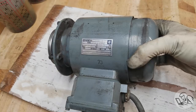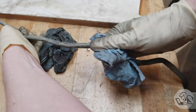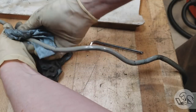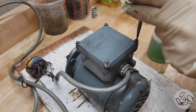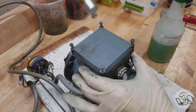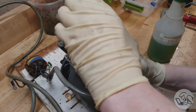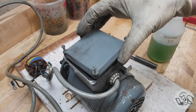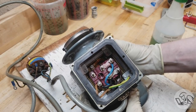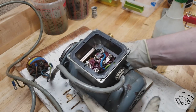The motor looks to be in decent shape other than being filthy. In fact, the main power cord for the grinder is also incredibly filthy — I actually thought it was black, but it's actually light gray. Once I got all that grit cleaned off, I could take a closer look at the connections inside the motor to make sure everything's okay. There's no signs of burning or anything. This lid hasn't been off in a very long time so it took some persuading, but everything looks great in there. The motor is already wired for single phase 120 volt, which is what I want. At this point I wanted to rig up the motor and see how it runs, because I haven't actually seen it run yet.